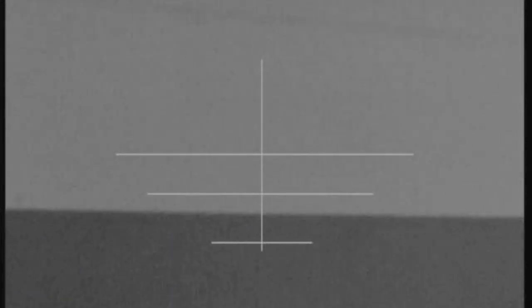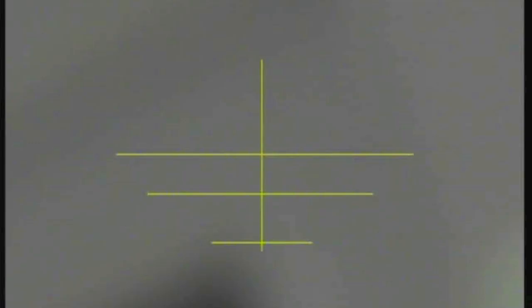I've jumped to a clip taken later on. I decided to experiment with the crosshair — there's a slightly different one I tapped in. What I actually saw from the unit when recording direct from the video output: the gate at the back with the illuminator off, then flipping the illuminator back on — it's like daylight. It automatically switches to black and white. The crosshair is in white here, but it's normally set to yellow. You can choose about eight different colors. The camera automatically switches between black and white in low light, and color in daytime — though you can keep it in color at night if you want to keep the crosshair in yellow, blue, pink, or whatever color you select.